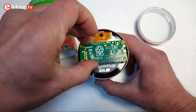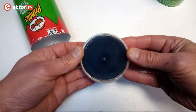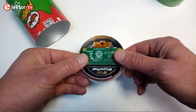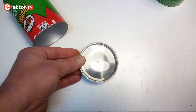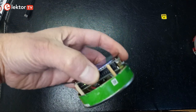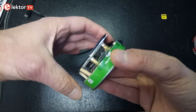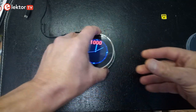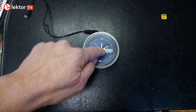I happened to notice that the diameter of the HyperPixel2r display is almost the same as a Pringles can. It fits exactly inside. Therefore, I decided to build my YouTube subscriber counter clock into an empty Pringles can. I cut the top and bottom of a can and attached the display with Raspberry Pi assembly to the bottom part with standoffs so that the display came flush with the inside of the ring on the top part. Now the display is protected when the lid is on. Touch still works with the lid on.